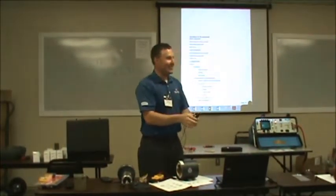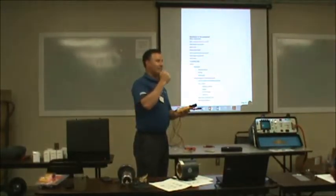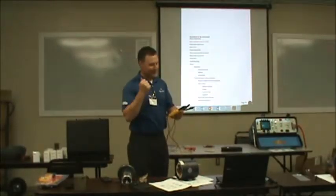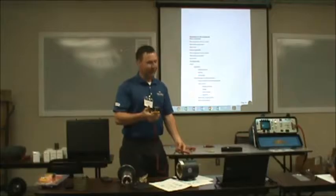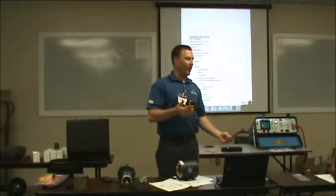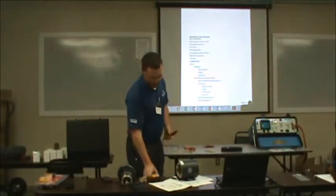Clip them on your wires. Got your meter in hand. You're talking to your buddy on the cell phone that's back in the control room. Turn the power on. Then you have your buddy on the phone. We've got 480 volt, 480 volt, 480 volt. All right. So we verified what we've got there.